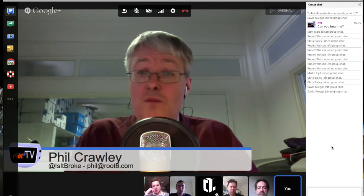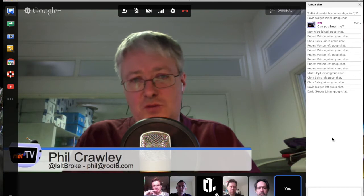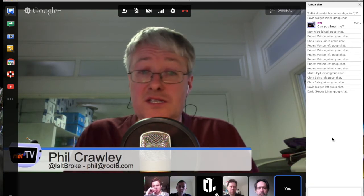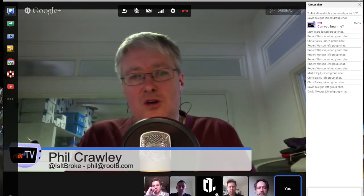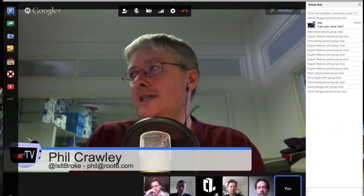But you're right, when we did it with the Klein, which is a bit more sensitive, the noise wasn't such a problem, but you can still see the noise in the blacks. But the OLEDs were splendid in the blacks. There's no noise in the blacks, and getting the black color correct is just a question of looking at the probe and not having to judge it by eye. So a combination of OLEDs being much more color consistent all the way down to very dark colors against LCDs, and the probe being a bit more sensitive, means we're in a different situation.